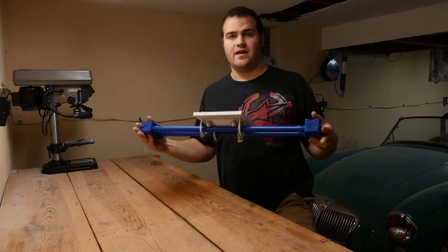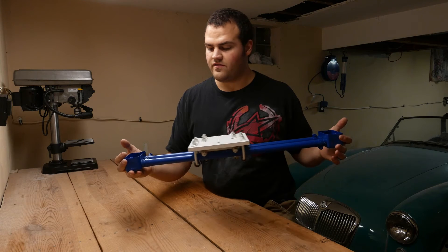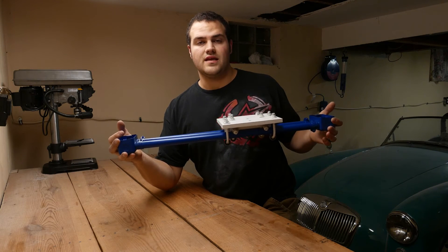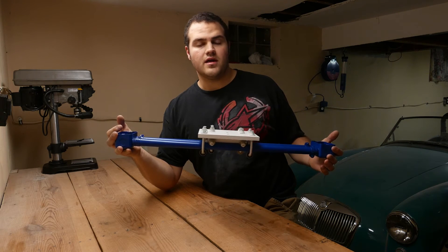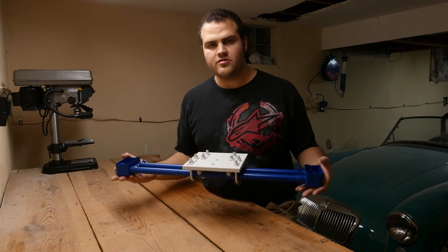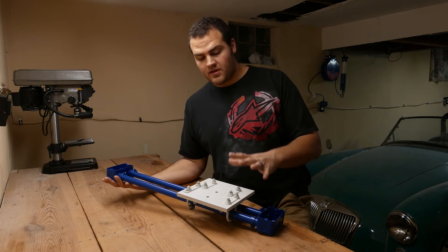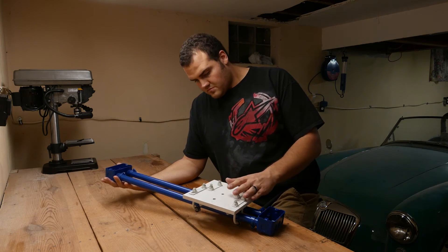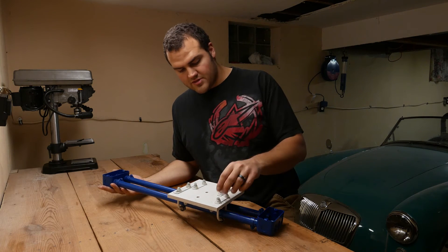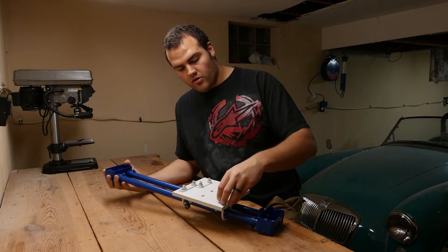It's complete, and holy cow is it smooth — it is nice. I couldn't get more nuts on top of the threaded rod to do jam nuts, so I put extra hot glue all the way around every single nut. I readjusted everything so it was exactly how I wanted — perfectly smooth — and put hot glue all the way around all the nuts and around the thread. These nuts should not move; they're not under a lot of stress so there's no reason they'd ever move. I also filed the tops as best I could, but they were still sharp enough that I didn't want to risk myself or anyone I'd loan this to cutting their hands. So I covered the tip of all of these with more hot glue — you're not getting cut from this. It's perfectly safe.